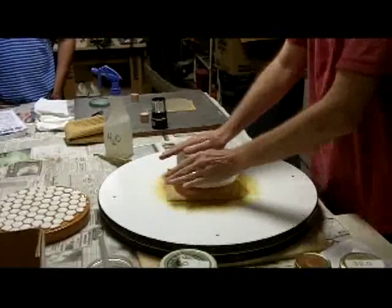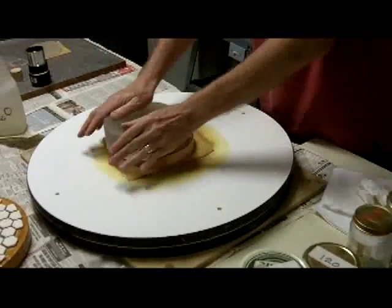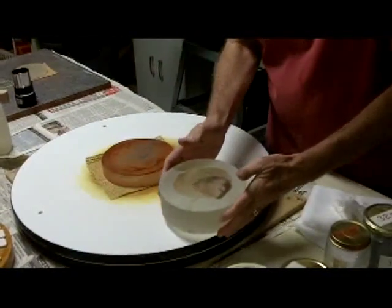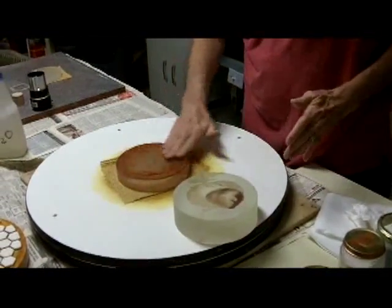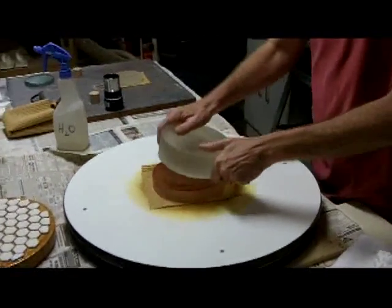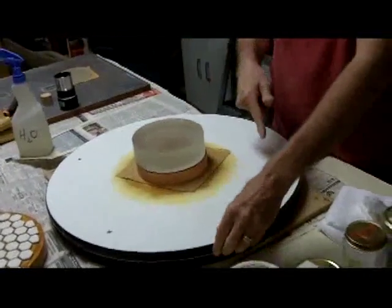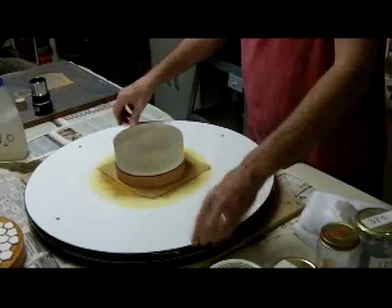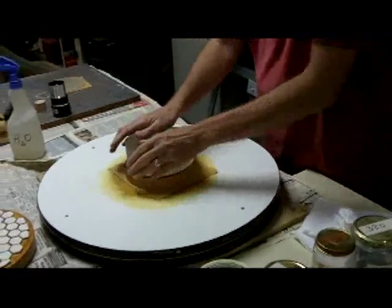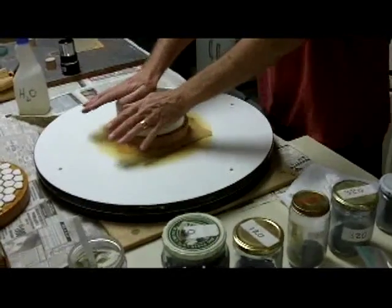the standard grinding stroke. It's also a polishing stroke for almost the entire operation of this mirror grinding and polishing. Each time you start, you turn one this way and one the other way. So we're going to go this way, and we'll go this way on this one. And it's the same thing. You want to go back and forth with your pressure right here in the middle of the tool.